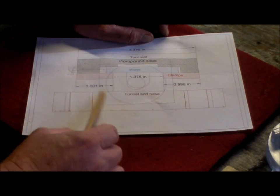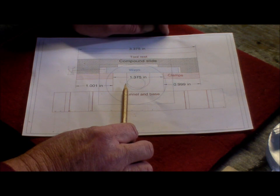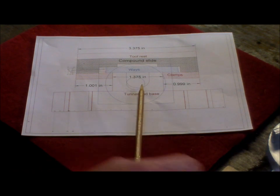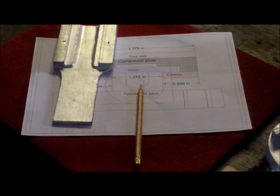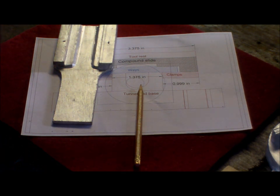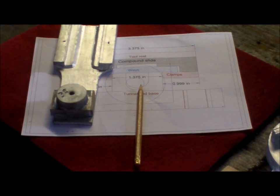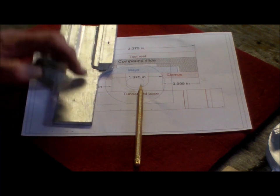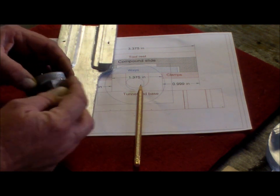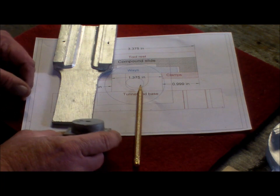Now, staying with this drawing, this screw support is about 60 thou off to one side, 65 thou, something like that. So I need to move it over. You must remember that screw support, which I threw on the ground, excuse me for a moment, I'll pick it up. That screw support needs to be the size of that tongue. It'll look terrible if it's larger. So I have actually put extra material on to make it too big. Again, I can machine that on the lathe or the milling machine.